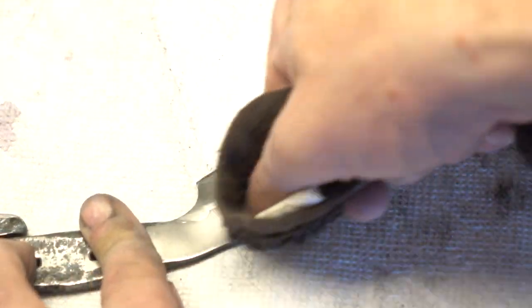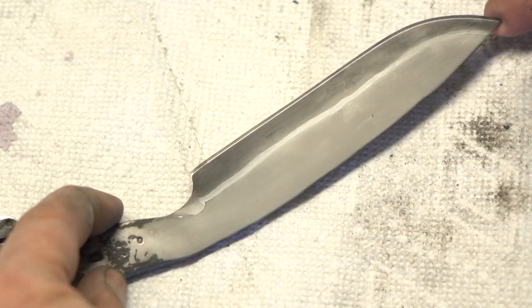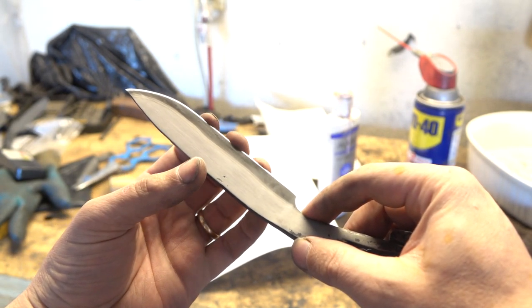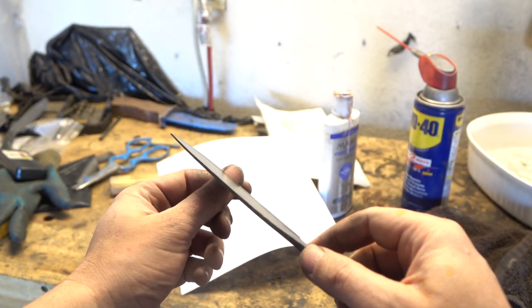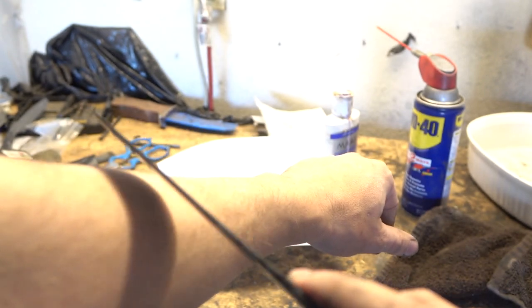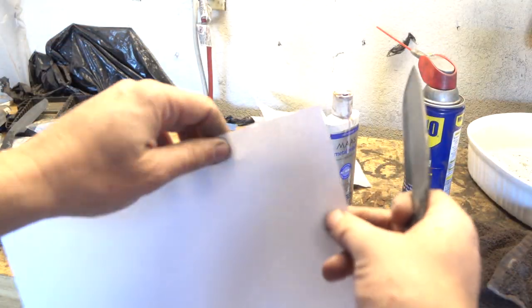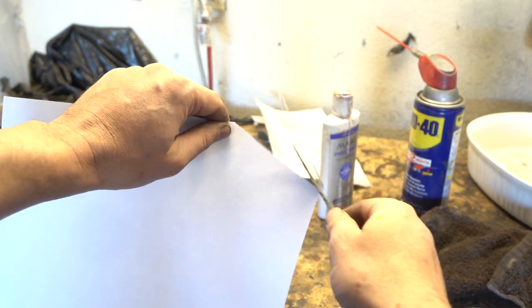Next I'm going to take some metal polish and try to bring out some of the difference in the etching between the three metals. Murray Carter checks sharpness of his knives by applying three fingers along the edge and based on how much pressure must be applied before you sense you're about to get cut, you can judge sharpness. I like to take it across my thumbnail and see that it catches without any pressure, or I usually also check it on shaving, which I think is an excellent test of geometry and sharpness. Many people cut paper of varying thicknesses, but I prefer the shave test and I've actually grown to like Mr. Carter's three finger test as well.